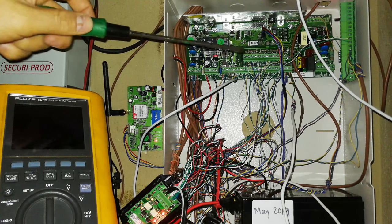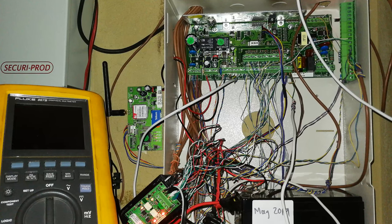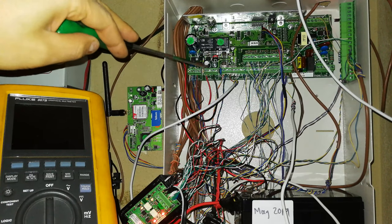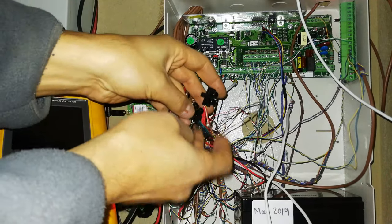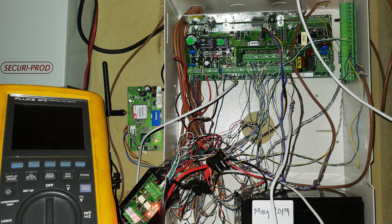This happens to be an IDS alarm system. It can charge a battery of about 7 amp hours, although they say you can put a maximum of 12 amp hours - but 12 amp hours is still not going to be enough for a really large alarm system. You'd normally connect everything up to the power rail on the alarm panel - there it says auxiliary plus, 12 volt, zero volt - and eventually that terminal block will be full of red and black wires, all draining directly from the battery.